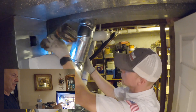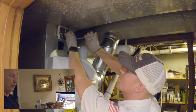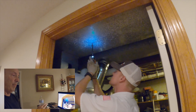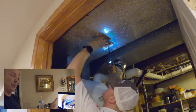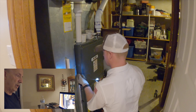This is now the bypass pipe — it's on the supply duct. Warm air is going to come off the supply plenum, go through the bypass pipe to the humidifier, where it then pushes that warm air through a wet water panel inside the humidifier. Then it's drawn back — there's a negative pressure on the back side where it draws the air back into the return air. There's a negative pressure in this duct.